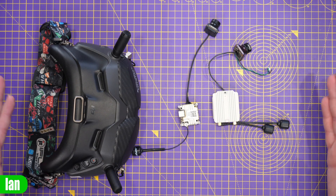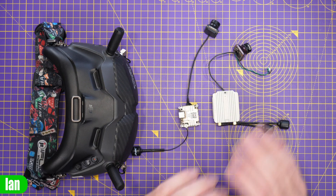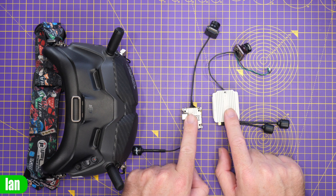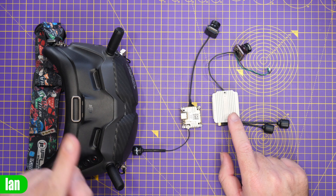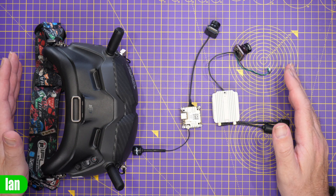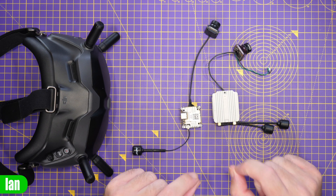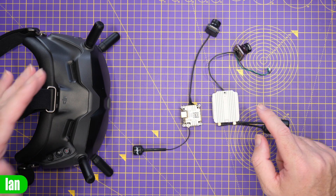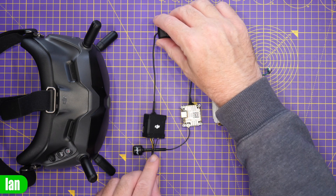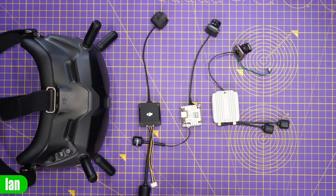Now for FCC hacks and power output by goggle type. The V1 goggles with the air unit retain all the same hacks regardless of firmware. NACO allows you to get FCC mode up to 700 milliwatts in non-FCC areas, and NACO underscore power installed on the goggles allows you up to 1200 milliwatts. The situation is identical on the V2 goggles with the original air unit in DIY FPV mode. For the V2 goggles with the O3 air unit, you do not use NACO — you have to use the HAM file, as explained in a dedicated video linked in the description.